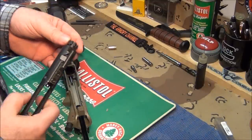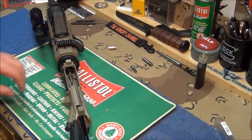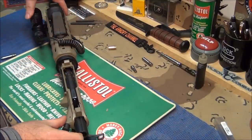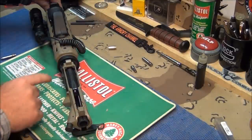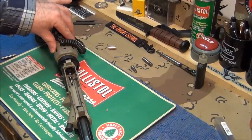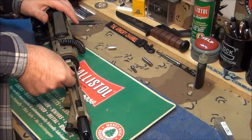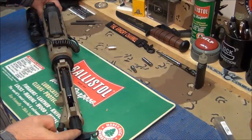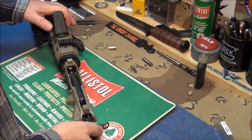Before we put the gauge in, the bolt carrier has to be extended so you can get it in the upper. Without the gauge yet, let's put the bolt in and see how it locks in - nice and flush back here, locks in really good. Good. Take it back out. Now I want to put the gauge in. This is the no-go gauge, so we'll put the no-go gauge in and try to close the bolt. Common sense says it should NOT close. And it does not close - that's good. It's telling me so far the headspace is correct.